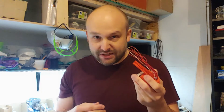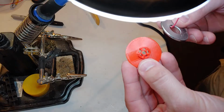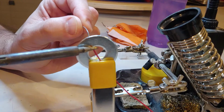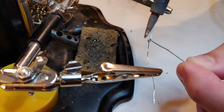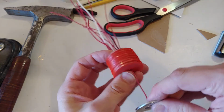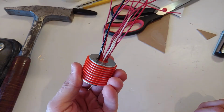It took me the better part of a day to get this built because aside from the time it takes to print all of the pieces, I had to sandwich the washers in between the thin rings of plastic, solder all of the wires together, get all of the spring wire bent into the right shape, and yeah, just the whole assembly. It took me an entire Saturday to get that done.